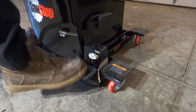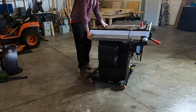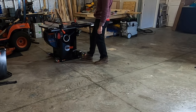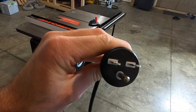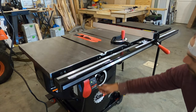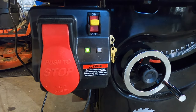Now let's focus on the mobile base. There's a foot pedal on the base that pumps up and lifts the saw, making it really easy to move across the floor. I'm planning on keeping this in one place for the most part, but if I wanted to move it, it's very easy. Once it's in place there's a down lever you tap with your foot and the saw slowly sits back down. The saw runs on 220V, so make sure you have the correct outlet — I ran a new circuit from the rafter to keep it out of the way. With it plugged in you can crank the blade up and turn it on; there are two separate switches to actually start it.